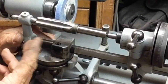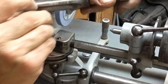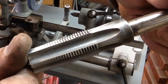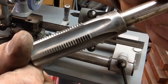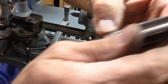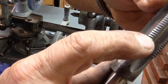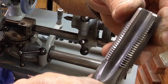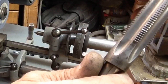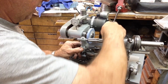And that's basically the procedure — I'll continue to work it back and forth until we get it down to dimension. We are getting a nice even grind here. You can see that relief going on there and it's pretty uniform all the way around — I'm very happy with that. Alignment looks good. You can see the beginning of the cut right there, and it tapers with the relief, trailing back to our trailing edge, consistent all the way around on each one of the flutes. I'll continue on, and when we get close I'll bring it back for another look.